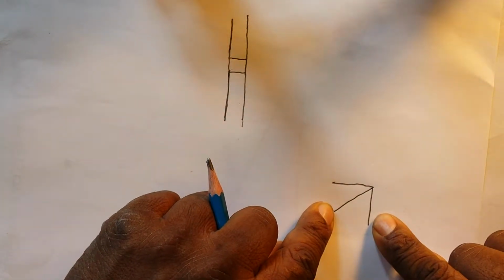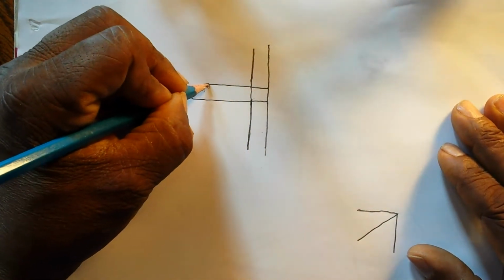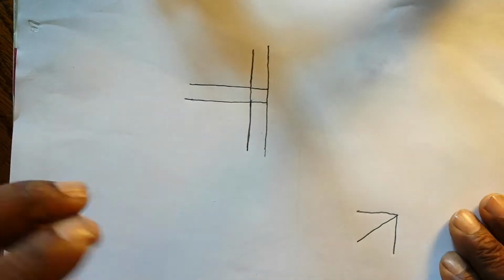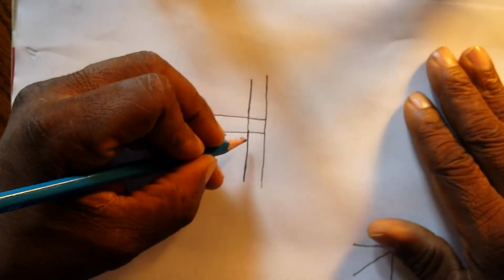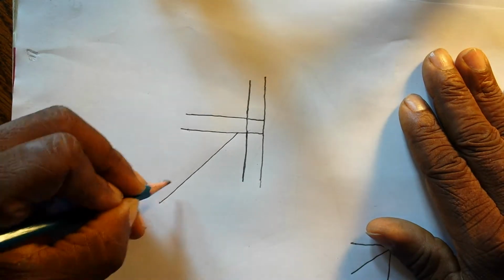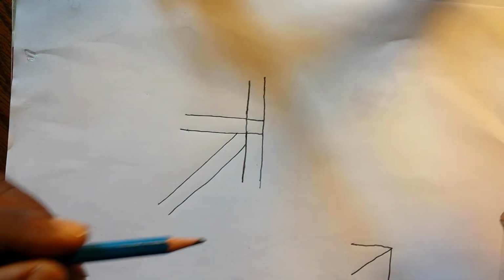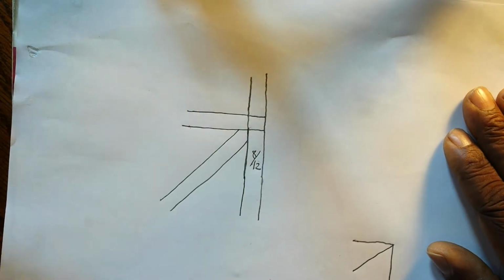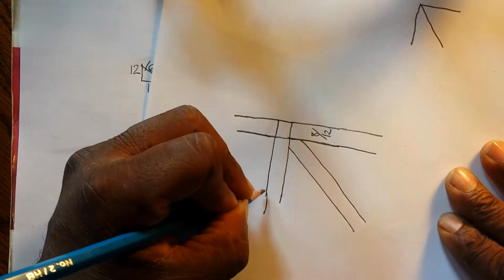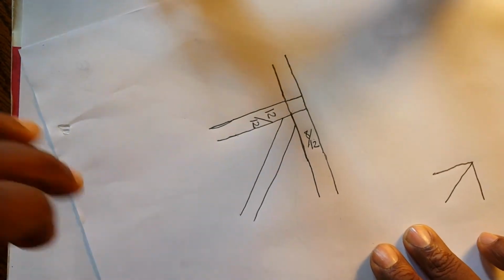Now, I'm going to give you an example of this, drawing it out with the width of the stock. So let's say this is another rafter here. This is the 12/12 side, or that rafter, or this rafter. We're just looking down at the roof, as if we were hovering above it as it was being framed. Then on the hip, you're going to have this. So this is your common for the 8/12, let me put 8/12 here. This is the common for the 12/12 side, and this right here is your hip, which we don't know what it's going to be right now.